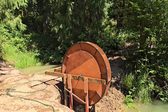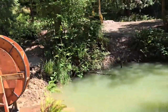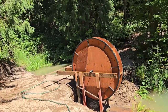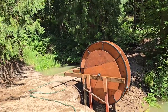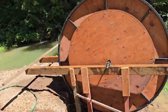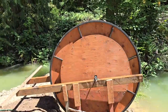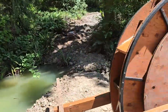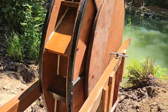The water wheel is built and on the rack. I just put a hose on it — we pump water out of this pond for irrigation — and it was doing about one rotation every second, maybe a second and a quarter, so I might have to slow it down. We haven't built the flume yet but it's on. It's still rolling — I turned the water off quite a while ago. It was pretty well balanced; it was just rotating a little back and forth, so I put on a couple of those shorter boards to stop it.